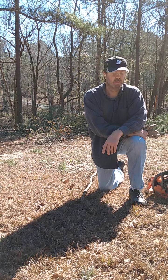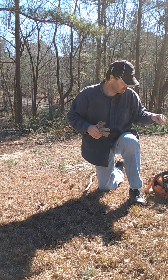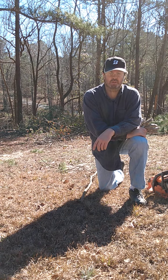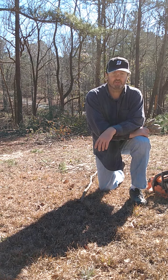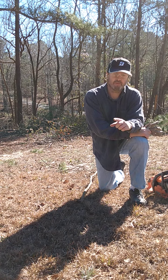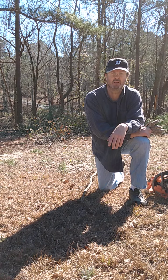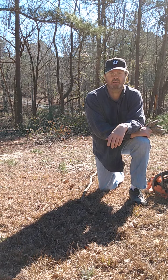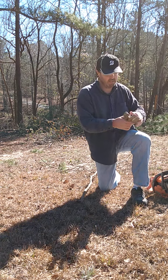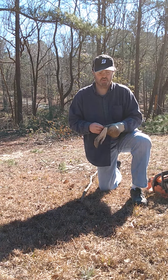Use proper equipment. I came back up just now before starting recording this video and ensured that I had plenty of bar oil in, and the gasoline and oil mixture for fuel was topped off. And I ran the file over the teeth real quick just to make sure it's in pristine cutting condition, so I won't have any problems when I get down there. So I'm gonna walk down the road, come in the side, and I'm gonna cut, and hopefully everything goes well, and I'll come back up here and talk to you.